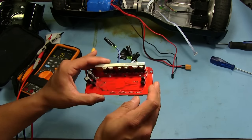About 0.7 volt drop there. I don't know, let me see, I can't really tell what they are. Okay, so these two are both marked Y2, so these both are going to be the same, and that one's marked G1. So maybe if this one was an NPN part, these might be PNP, so let's reverse the leads here. And there we go, okay, 0.7 volt drop, about the same. So this one here should be about the same. Oh, touching leads together, okay, so that's good. You can't really see what I'm doing, but yeah, right there. So all three of those look like they should be fine.